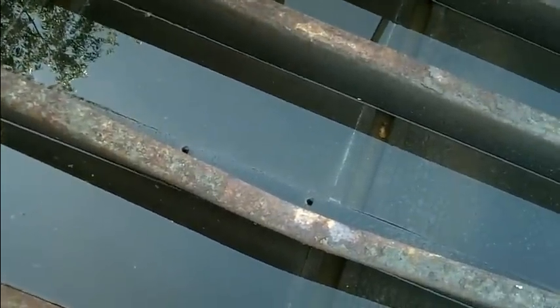So what we're going to do is plate the whole top of this with 1/4-inch plate, and it's all going to bind it together. That bent rail, I'm going to straighten it out with a sledgehammer. That's probably why it was downgraded to a storage container. And this is actually a plate for the rails. That's pretty stout right there. But all this is going to be sealed up with a 1/4-inch plate. It's pretty easy to do because it's all straight and flat. We're going to button weld these to the rails.